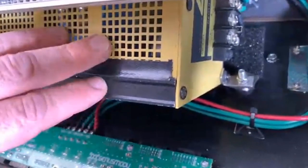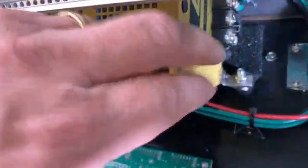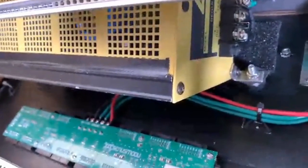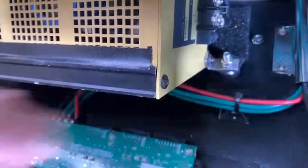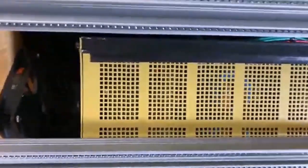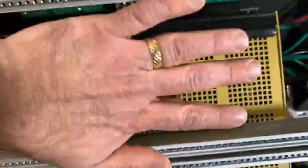The other thing I've done is linear power supplies will vibrate more the more stress you put them under. And if you've got them just lazily bolted to the bottom of your case, they could start vibrating your entire case. So Matthew Goyke actually warned me about this ahead of time. So I've got rubber grommets where I'm attaching to the power supply, and these big rubber isolators wherever I attach to the case, just to cut down on that possibility. Now, this power supply still puts out physical mechanical noise. The transformer in it actually vibrates even under no load, and you can hear that buzz a little bit. And I'm hoping that just putting modules over it is going to mute that sound. We'll find out.